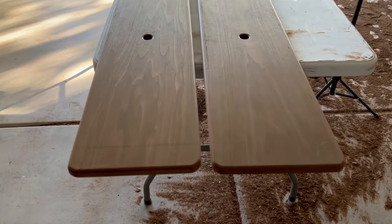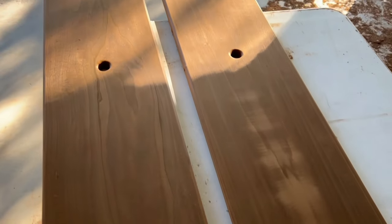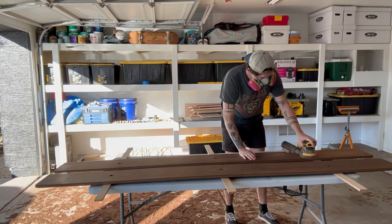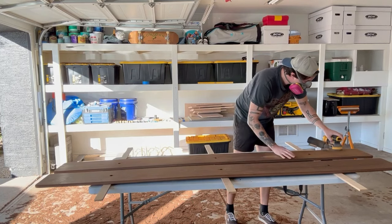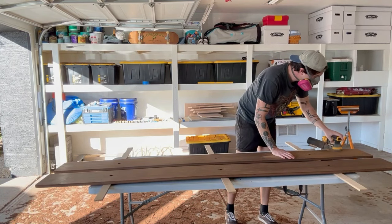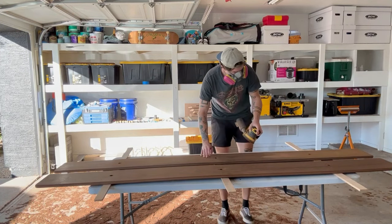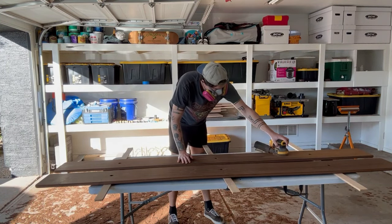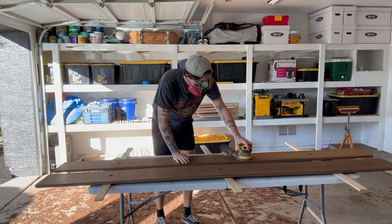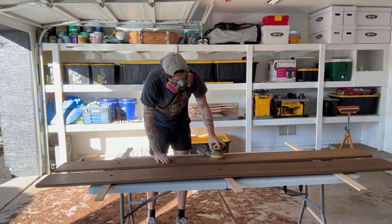Here's a quick preview of how beautiful these boards are looking compared to when I first brought them home from the lumber yard. Now we get to every woodworker's favorite part: the sanding. I'm just going to do my normal sanding technique, going over every surface — top, bottom, and all the sides. I start with 120-grit, then work my way up to 150, and finish with 220, mostly just getting every edge nice and smoothed over.